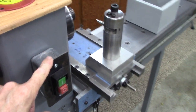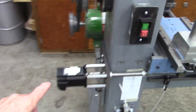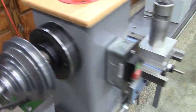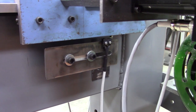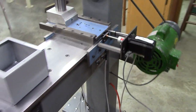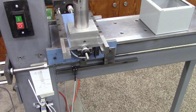I put a magnetic switch on there before I went to Knoxville. After I got back, I installed the stepper motors — one on the front and one on the cross slide. And I wired in these limit switches. That's a limit switch on the front, and on the back side there's a home switch. There's a little difference between the two: the home switch just tells it a reference point, and the limit switch is to stop a crash when you mess up on your programming.